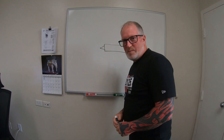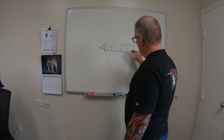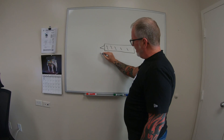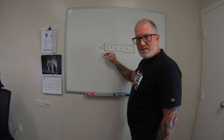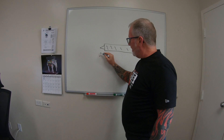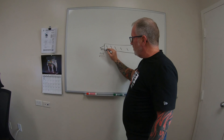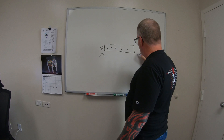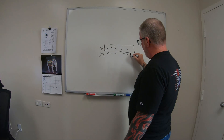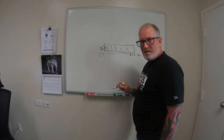Okay guys, so this here is the whiteboard. What you have is your screw in here. What they call pre-decompression is a suck back at the very beginning of the screw. What that does is it keeps you — like if you're bottoming out and you've got no cushion — that'll help you relieve the stress to keep from breaking a screw tip. But if you have a cushion all the time, then you might not use pre-decompression. You'll use post-decompression at the very end. So the screw will meter back, meter back, meter back, and once it gets to that very last bit, it's going to suck back to get the pressure off the head area. That's the suck back.